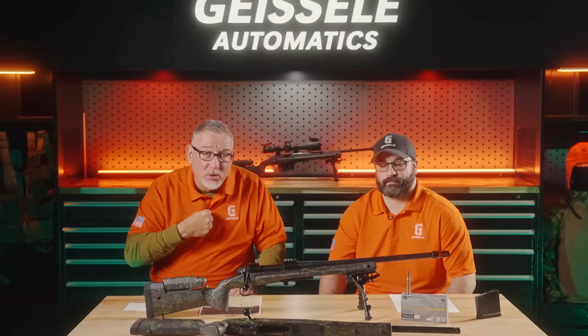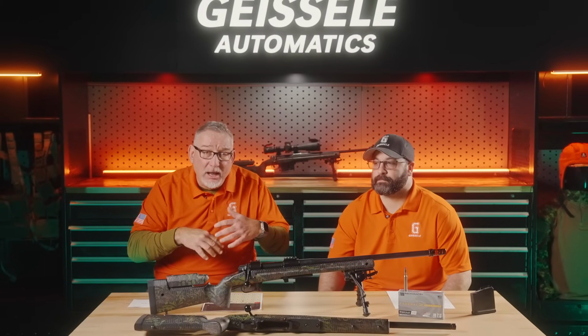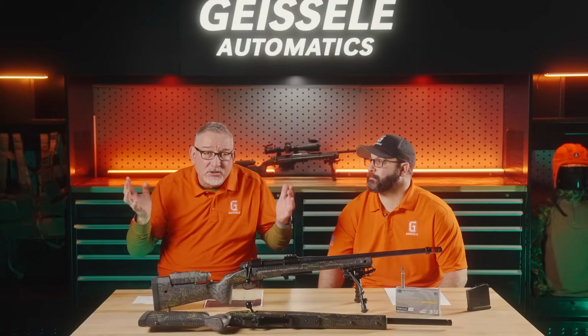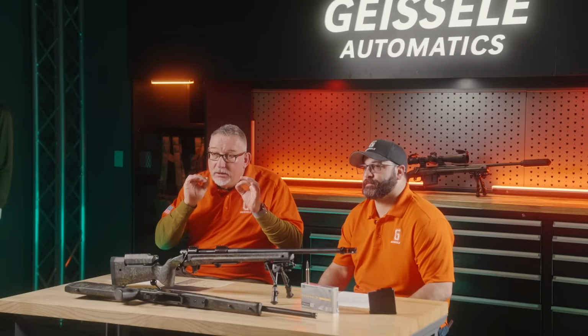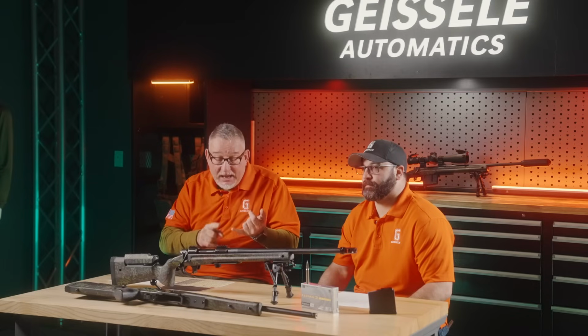And we gun drill it, we ream it, and we cut rifle it here in North Wales, Pennsylvania. We do it ourselves. Our cut riflers are not these old machines that look like somebody built in their garage or some World War I Pratt & Whitney machine that has been rebuilt. These are CNC cut riflers that we designed and made here in our factory. We have our tooling so closely defined that we are ecstatic about the quality of our barrels. We've realized that much of accuracy comes from the quality of your barrels. How straight you gun drill, your finish after reaming.